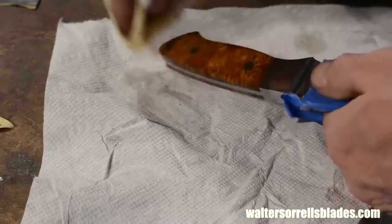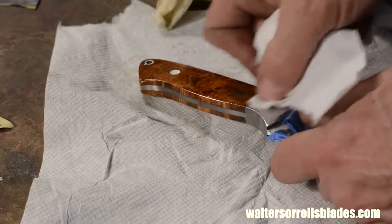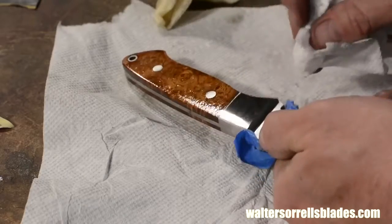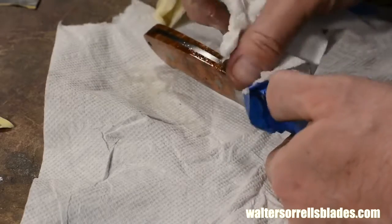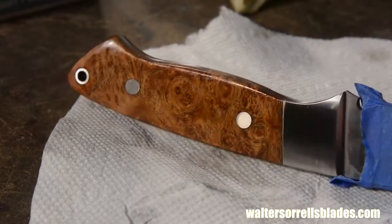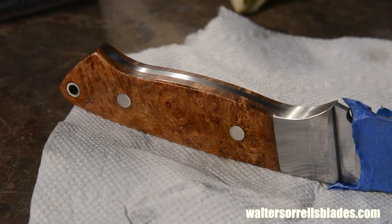Here's the issue for me. If you want to bring out the grain of some outrageous wood, the best finish, in my humble opinion anyway, is nitrocellulose lacquer like they use on high quality guitars. Aside from the health risks, complication of application, blah blah blah, I just don't like that slick, plasticky kind of finish on a knife handle. It looks great, but I just don't like the way it feels. And you could do this with polyurethane, water-based, all kinds of other things, but I don't like any of those, really. On the other hand, you spend the time and effort to put some sweet-looking piece of wood on there, you want to show off the character of it as much as you can, and if you just dunk it in a bucket of tung oil, you may obscure a lot of the detail. All that said, on balance, I still prefer oil finishes from a tactile perspective because they're a little grippier and more natural feeling. That's just me.